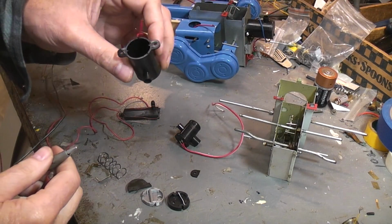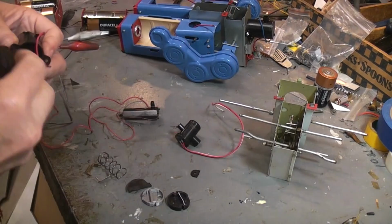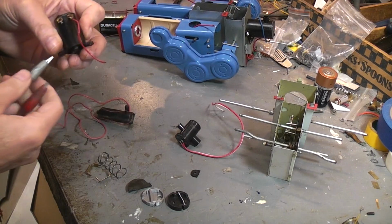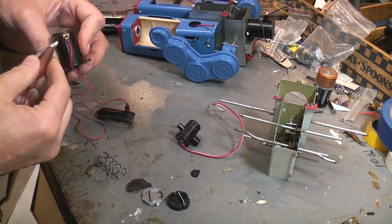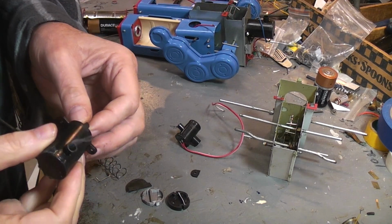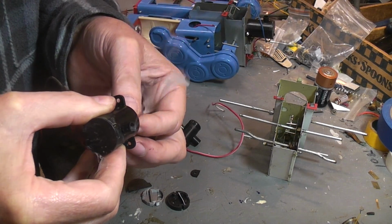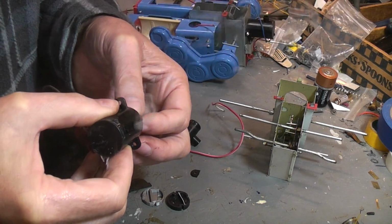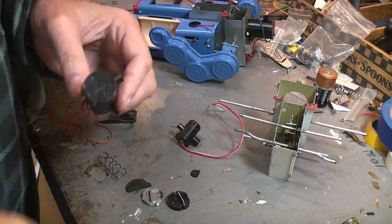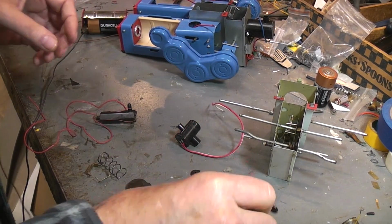You can take any of these newer ones. They don't smoke very well. Let's put a bellows back inside this one. Let's see if we can get it going, because it should. These are normally defective toys that don't have any runtime. And with the bellows, I don't have to get my mouth down there. There we go. So you can see the bellow design was a good idea, and it does work. It's just not enough of a reservoir for long time operation, so you can get the toy and it'll initially smoke, and then the more you play with it, it kind of stops smoking.